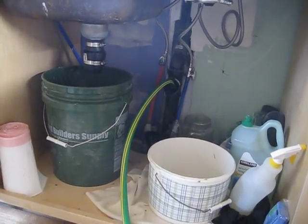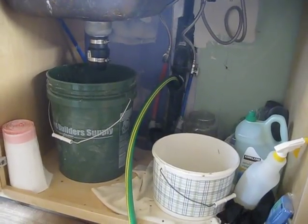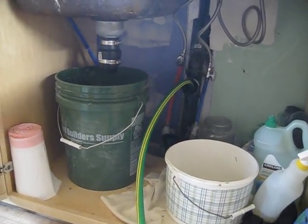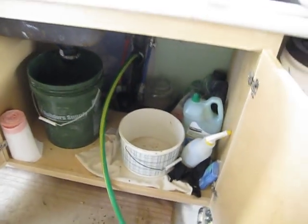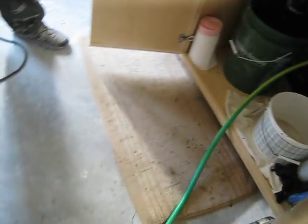But what I did is I sent a water hose down there with a bladder attached to it that expands out to like 2.5, 3 inches. It creates a pressure vacuum and it allows the water to kind of blast without backing up your sink, you know what I mean? And it sounds like we got good water flow just then. It was trickling, now it sounded like it was actually flowing.